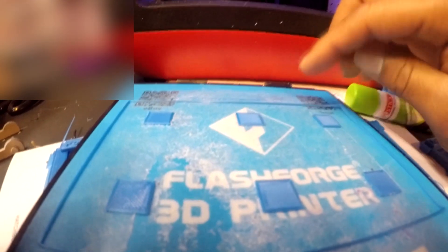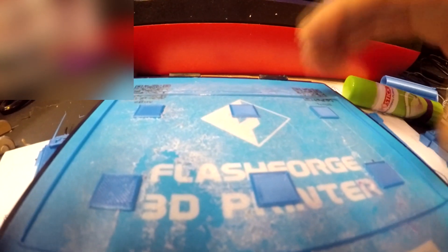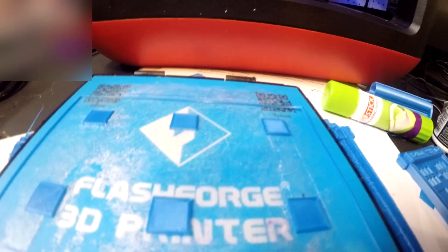Let's cover the first step you can do. If it's an issue as far as your print's not sticking and it is even, then just simply apply some painter's tape. Here's some that's on my Monoprice. You can pick this up at any hardware store - really cheap. Don't layer on top of each other; try to place it next to each other as close as possible. Your prints will stick to this. Cheap, effective solution - it'll work great.